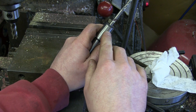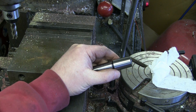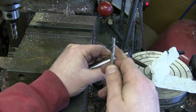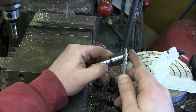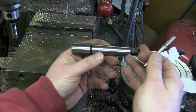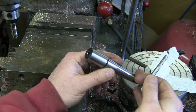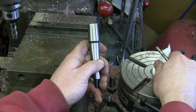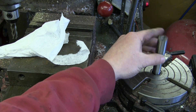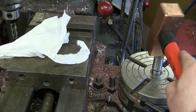We need some retention — we're going to put a grub screw in here. The only problem is drilling on a round is going to wander on us, so we have to mill this flat. The problem is we're working with two tapers — how are we going to hold it in the vise to mill it dead nuts flat? Well, as it happens, my rotary table's center hole is Morse taper 2, so we can just seat it right in there.